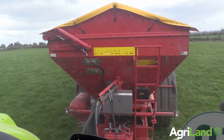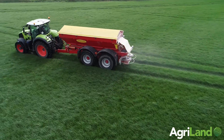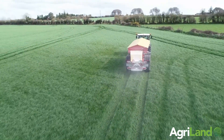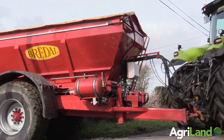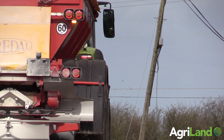The tractor itself is a massive upgrade from the 650 pulling-wise. When you come to a hill there's no fall to it at all, whereas the 650 would be back at the 170 horsepower mark — you would see a difference in traction pulling up steep hills. Fuel-wise, the Vario is going to be easier on fuel; you're probably going to save yourself two liters an hour. Power-wise and comfort-wise, there's no real comparison. It's only a matter of time before farmers realize that the efficiency and accuracy out of these spreaders is the way of the future, and they'll be going down the route of variable rate spreading as well.